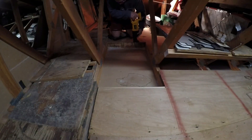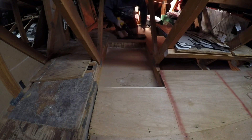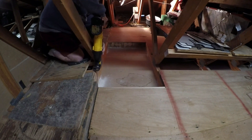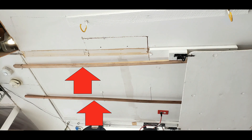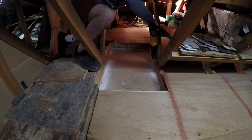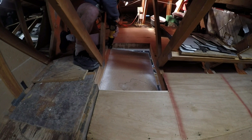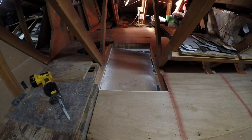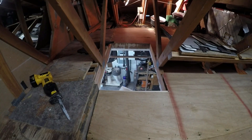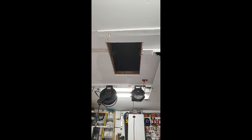Finally, we can make a hole in the ceiling. The hole will be the width of my rafters and long enough to take my motorcycle riding bag. Using a sawzall, I start by cutting both ends of the hole so I can locate where I'm cutting from down below. Install a couple of temporary boards below where you're cutting to keep the sheetrock from falling out, then go back upstairs and finish cutting. Clean up the sheetrock with a sheetrock finishing tool — you now have a big hole in your ceiling.